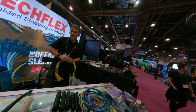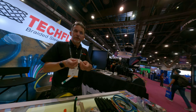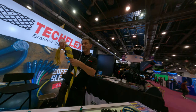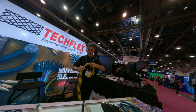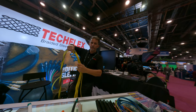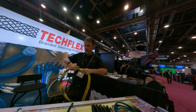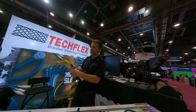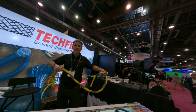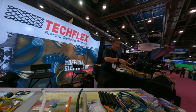You've got different options. If it's an existing application, this opens up so you can put it over the top. If it's something new, it comes in all different sizes and opens up quite a bit. A lot of people push it over one end and tape it down, and it'll run over itself — nice and fast for larger lengths. See how clean the one end is? You can terminate it at the other end with heat shrink or cable ties.